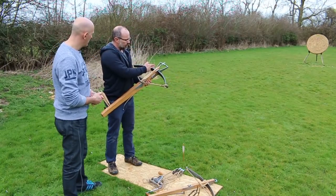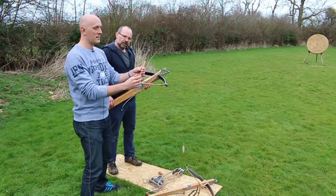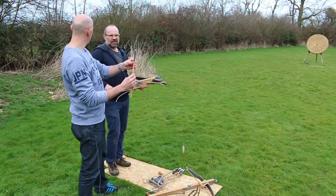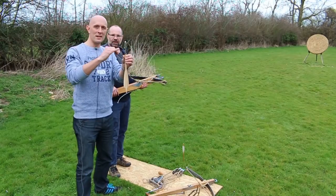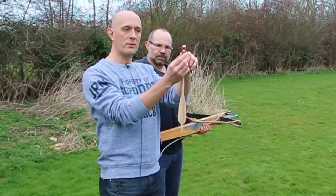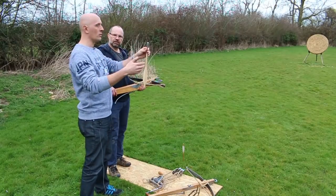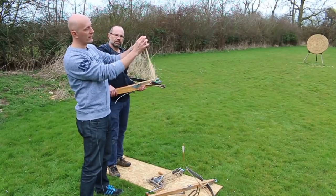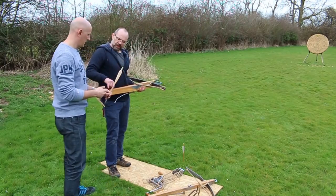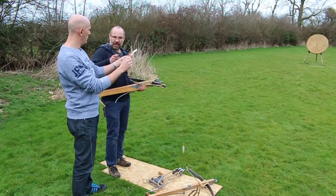You can see here that you've got an awful lot of bolt sticking out the front. This is what's commonly regarded as an armor-piercing type head — a plate cutter head, or a quarrel, or a short bodkin. It's not a bodkin like a long needle-type point; instead it's got quite an abrupt head with four cutting edges. So that once you've punched through the plate or brigandine, everything behind can pass with very little friction because you've made a hole big enough. If the head were round, it would have to stretch the metal to pass through, which takes a lot more energy than cutting.